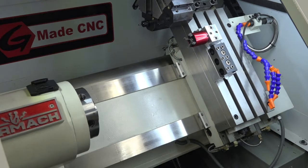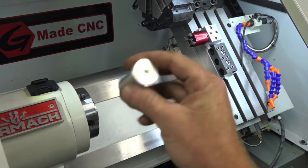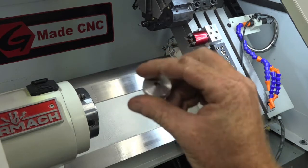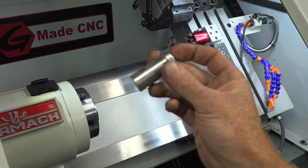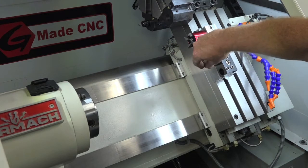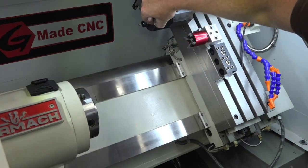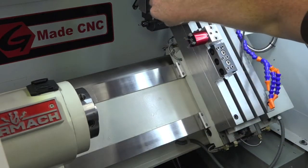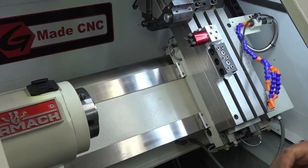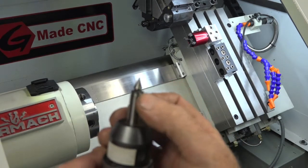What I use is a plug or slug — whatever you want to call it — that I made, three-quarter inch here with a flange. I drill a three-sixteenths hole in the center. What that lets you do is drop it into any one of these holes — they're unthreaded — or even in the turret you can do the same. In the collet we're going to be running one of these edge finders, a wobbler edge finder.